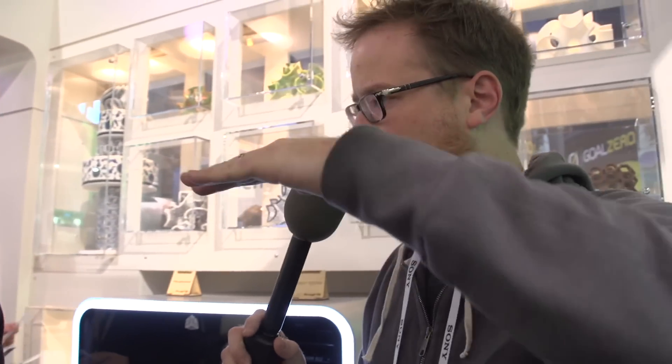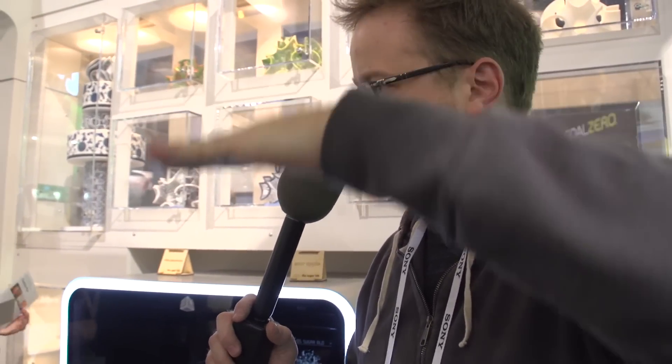So what happens is you print more — you start with the bottom layer and it sinks down into the material. We print a layer, lower it a little bit, print water on top, spread another layer, put water on it, and lower it a little bit more. Through many thousands of iterations you build up a three-dimensional object.